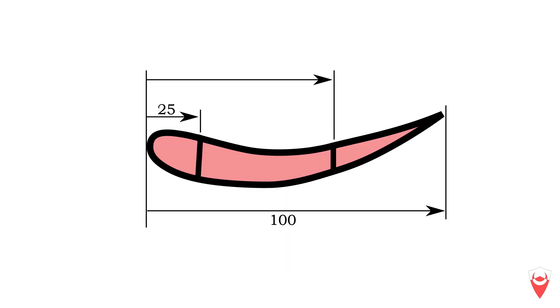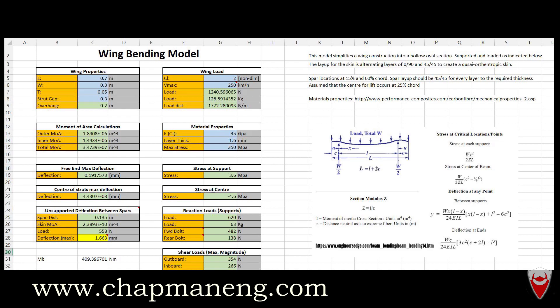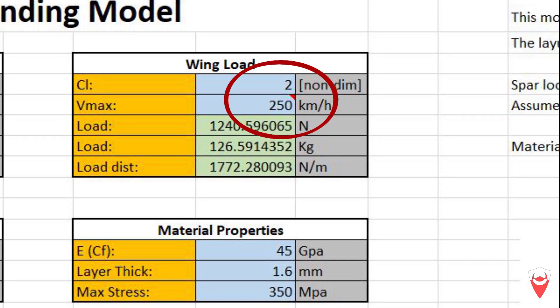I'll be using a front and rear wing spar at 25% and 60% of the chord respectively. These will be made from 45-degree biaxial carbon cloth with an approximate thickness of 2mm. Prior to the spars being laid up, I'll install drilled and tapped metal blocks which will bond to the spar and be the mounting points for the wing after it's manufactured. The wing will be skinned with 1.6mm of carbon with alternating layers running at 0/90 and 45/45. I've used a spreadsheet as a calculator to work out all the critical parameters on this wing — it's linked in the description below on my website if you want to have a look. It is a design tool, it doesn't give you all the answers, so use it at your own risk. I've used it to analyse deflections, stresses, and bolt loads at various places on the wing and size the spar and skin thicknesses to bring them all into a range I'm comfortable with.